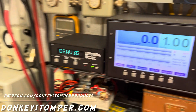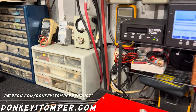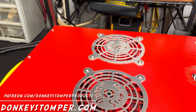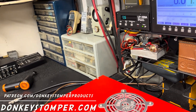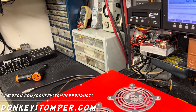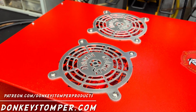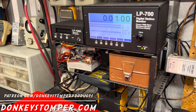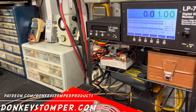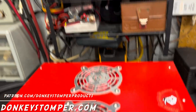If you've got an Icom — a lot of guys have got an Icom — they take their Icom 100-watt radio on to the amp and think 'I'll just turn it wide open.' When they do that, it starts making skyrocket average: 1,000 to 1,200 watts average on sideband out of a four-pill. That's when you blow transistors. More or less, whatever it does on AM average, you want to do less than that on sideband average.